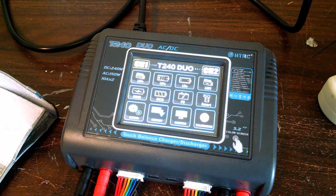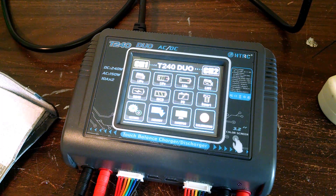Overall, the T40 DUO touchscreen charger from HTRC is a good beginner's charger. If you're going to be charging one battery frequently but want room to grow with a second battery, this is a good starting charger. It supports a wide range of battery chemistries and is easy to program, with a nice color touch screen. However, not being able to monitor both charging channels simultaneously is a big negative. I do like that it is independently configured and you can control how much power is being given to each charging channel.